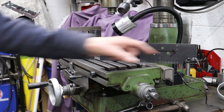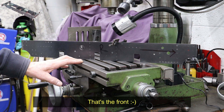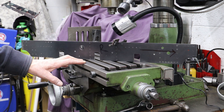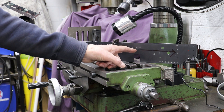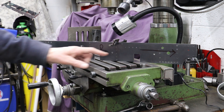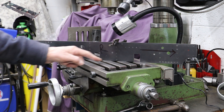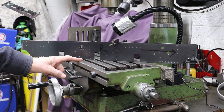I started off using the rear right as a reference point, and from there marking the centres for each of the axles. I think it's on the other side, but I scribed lines on these centres, and it's those scribed lines I then used as my reference point for the relative holes around that particular axle.